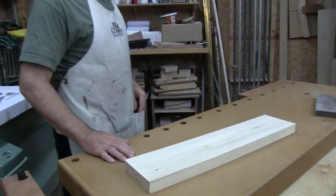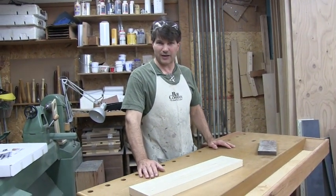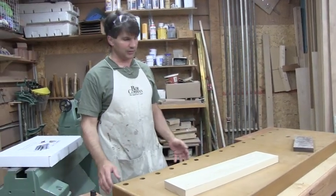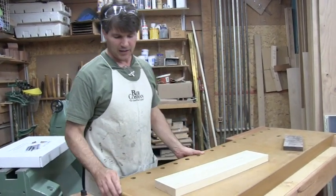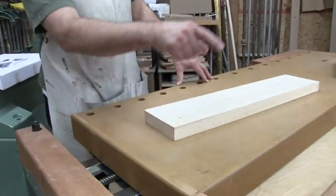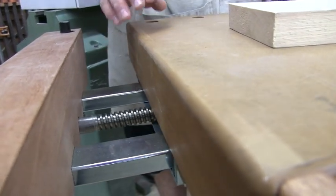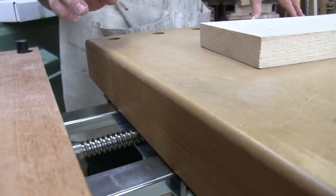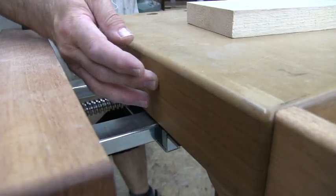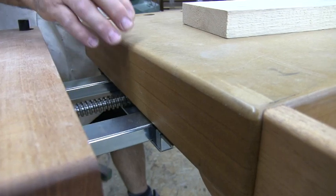It's extremely heavy, but if you glue it up flat when it dries, it'll stay that way — it's just a really good solid work surface. I put a fairly heavy cord around all the top edges, bottom edges, and outside edges, because the one thing MDF is really weak at is the edge. So to protect and keep those corners from getting beat up, that's what I did.